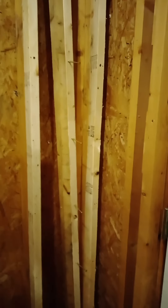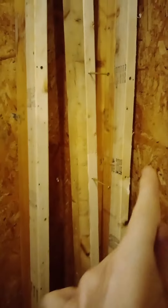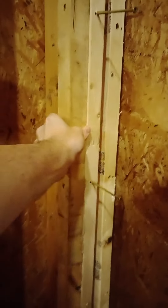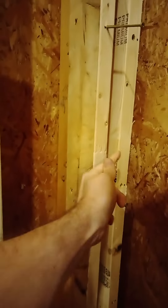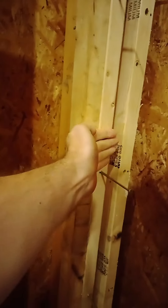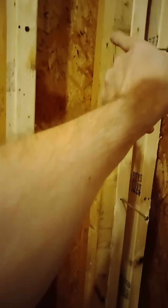What you're looking at is the corner in the southeast of the shed. Originally it was this 2x4 and this 2x4, but I'm building out the wall. I need to replicate that with the 2x3s. This board here is the last one to go up, and what's significant is the drywall needs a place to get anchored in. There's another 2x3 that comes out right here, so the drywall can go in on that piece and then on this piece, and that will work out really well.